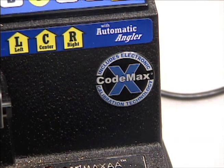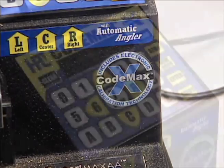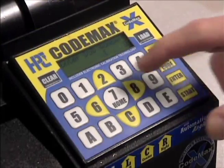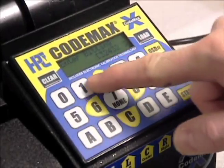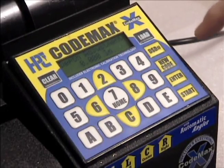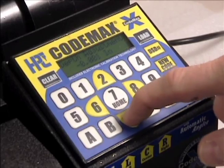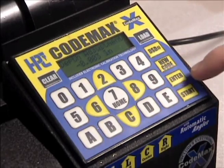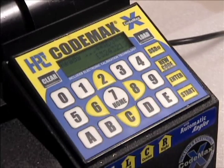DSD specific adjustments allow you to make minor depth adjustments for a specific key to accommodate worn locks or other special applications. To make a DSD specific adjustment, select the appropriate DSD number and then enter the bitting. From the ready screen, press load. Use the up arrow (2) or the down arrow (C) to change the depths. Press the enter button when you are done. Press A to confirm the adjustment or B to return to the depth adjustment screen.